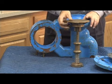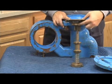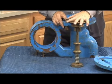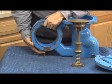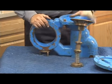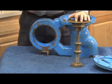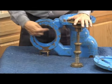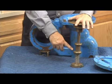Okay. So if this is where my diaphragm sits on the top, and this is my relief valve disc right here, what are these two things? Well, remember that air in, water out design? Well, with the smaller units, 3/4 and 1-inch, we achieved that with the body passageways and one O-ring. But because of the size of the body and the distance between the air in, water out design, we actually had to have two different seals.